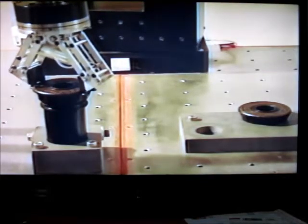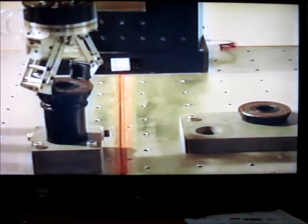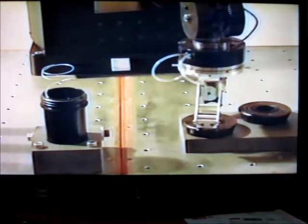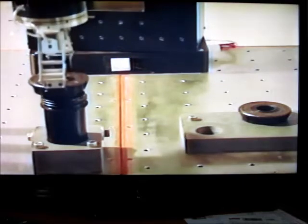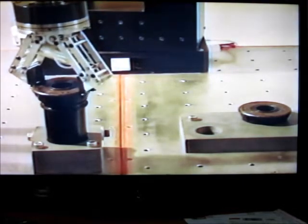Screwing on the cap is the most complex part of the assembly. The Zero first pushes down with a specified force to make sure the cap is seated properly. After rotating the cap, the Zero tries lifting it to determine whether the thread is properly engaged. If not, the Zero puts the cap back down, re-grasps it in a new orientation, and tries the threading process again. Completing the threading process requires that the arm move along the exact geometry of the thread.